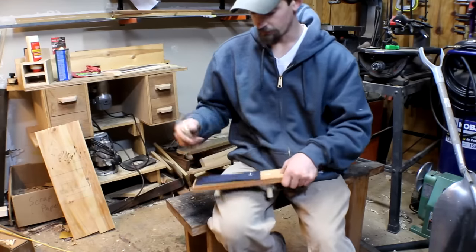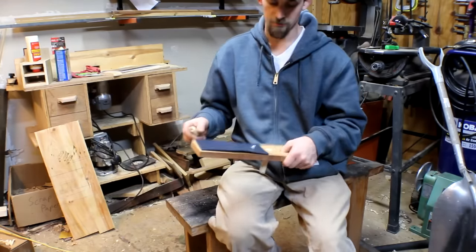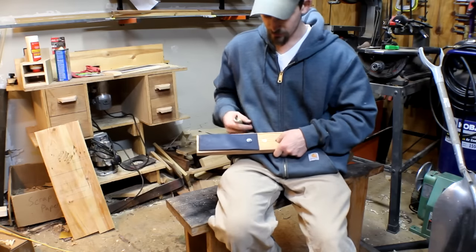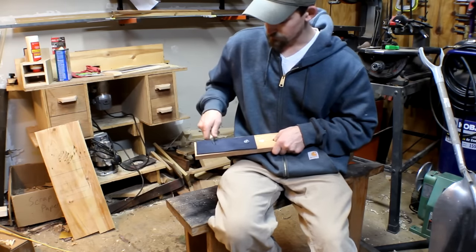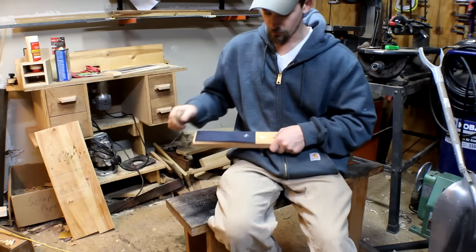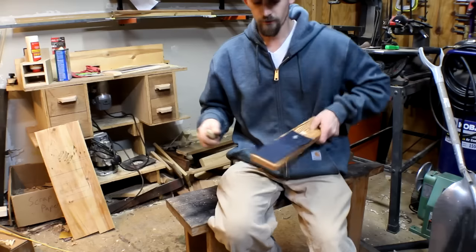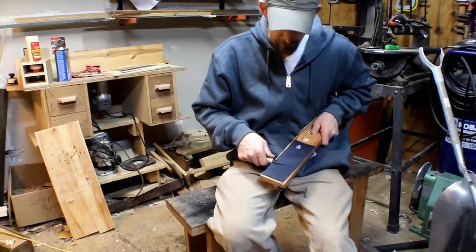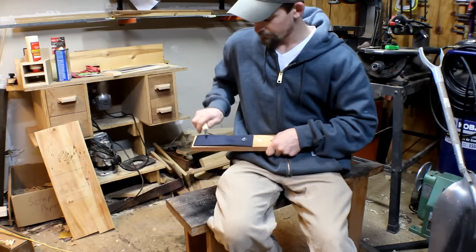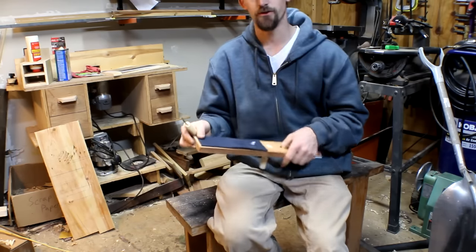And then, like I said, if you just have your carving knife and you decide that you want to sit down, instead of sitting at the bench having it hooked in, you can actually rest that peg right into your belt area, and then you can use the strop that way. It is actually quite comfortable because I rounded over the edge, and you've got your thumb hole to hold it. So you could even hold it against your side like this and go back and forth, hold it against this way. So there's all sorts of different varieties of ways that you can use this.